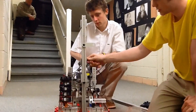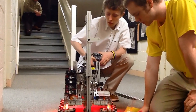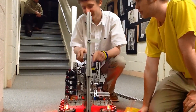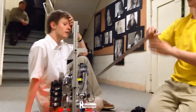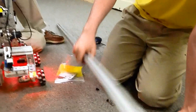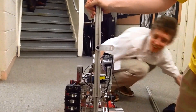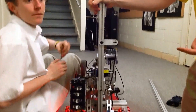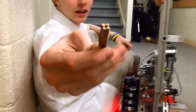You do have to use washers on some of these screws to be safe. There is a bit of difficulty — the interior of the 80-20 bar is not actually threaded. So if you want, you can take a tap to it. You can screw something into the top of this to either stop it from going further or simply as an attachment point. But you do have to tap that by hand, which does take a little bit of skill. Here's the bigger size tap.